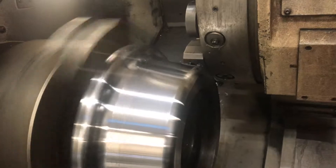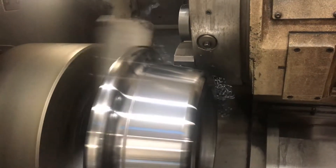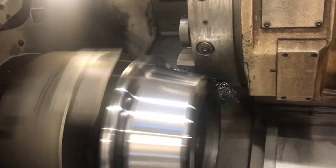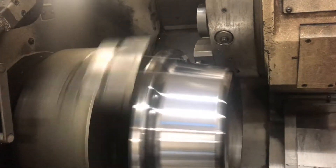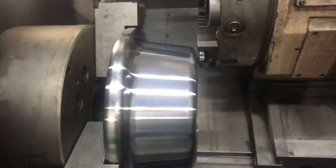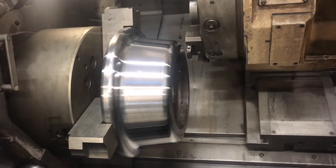I'm not going to touch my finger on there because there might be a sharp edge and I don't want to get cut. But I'm pretty sure that shape on the wheel is not real hot. Normally we run coolant on there, but let's stop the chuck and see how hot it feels, and then when we go back and do our other cuts we'll turn the coolant on. Not even hot — all the heat went out into the chips. That's all we're going to do for now; we've covered our time. We'll talk to you again here soon. So long.